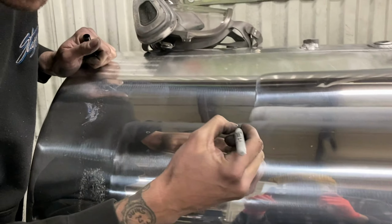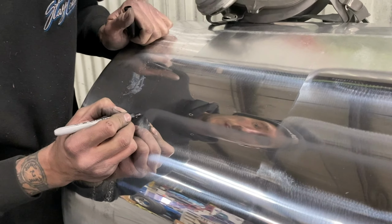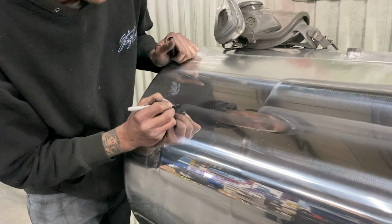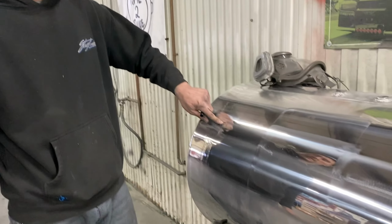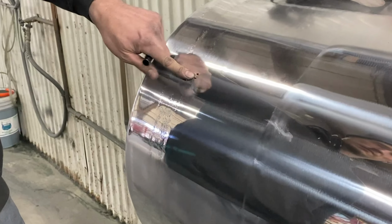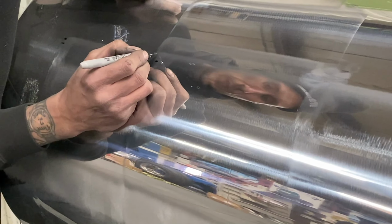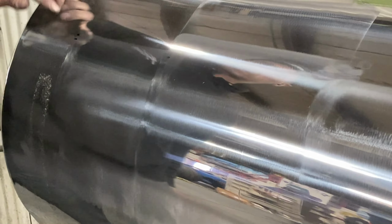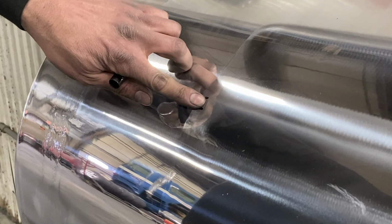But let me show you how close this shine line is. So I'm gonna have to do it over here, right? Here's your shine line, and right here's your black line, all right? So my overlap has to be literally that tight, all right? Now medium pressure, as we showed in the previous video, my shine line is here, and my black line is up here. It's quite a bit bigger. So we go from tiny, about the size of the marker width, to now we're almost finger width.